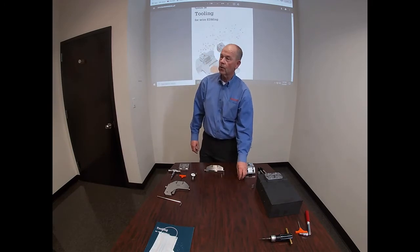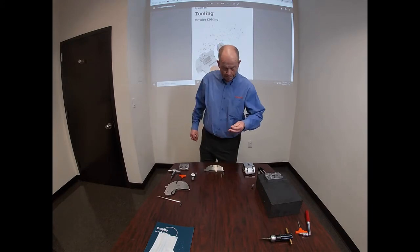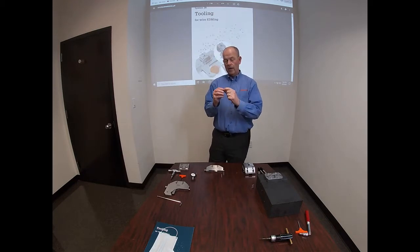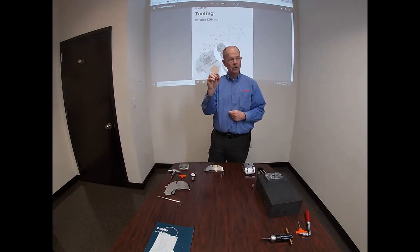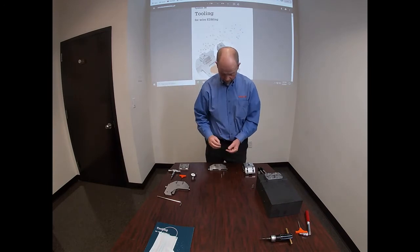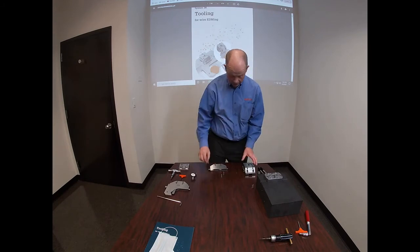To have full function, I also want to attach two other pieces. This is a dowel pin — the dowel pin is going to act as a pivot point. This is a cam pin. There is an eccentric part of this pin that is eccentric to the barrel. If you look at all of these fixtures, there's a round hole and there is an elongated hole. The eccentric on the cam pin goes down into the elongated hole.